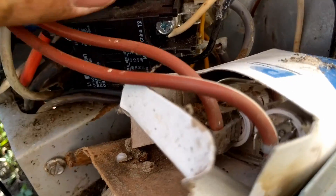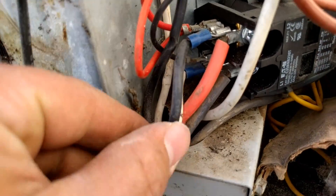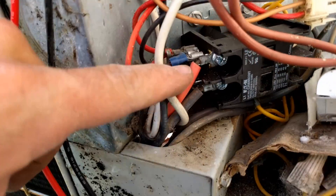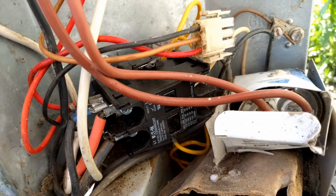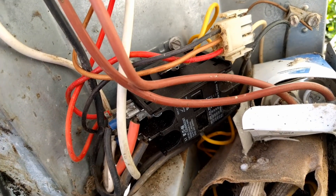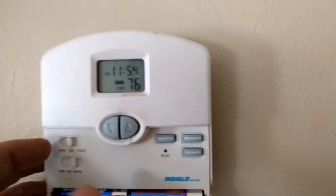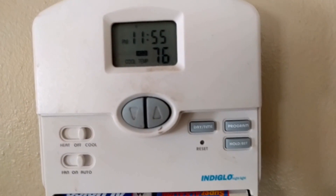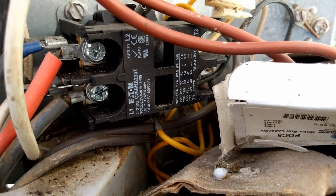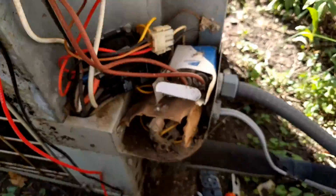All right, everything's hooked back up here now. You can see you just hook it up like for like — it's doable. It's almost kind of a headache because of the way the wires are all in there, but we should be good to go. So what we're going to do now is turn the power back on at the thermostat so that it sends a call to this, and this contactor should pull in if we did everything right. Put it back to cool. Cool is on here, and the fan did come on as well. The contactor did pull in, so now once we apply power to the unit, it should theoretically just turn right on.